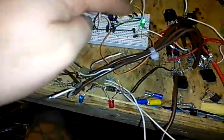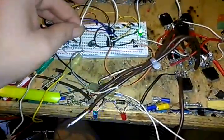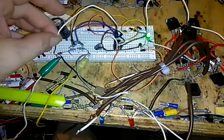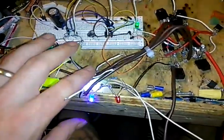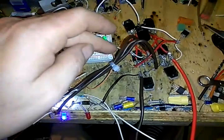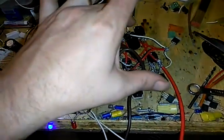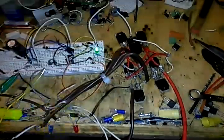Now when this is on, this is off, and I can show you that here using pin 7. Off on that positive and on that negative. So they do fluctuate back and forth, which is exactly how this is supposed to work. When this is off, this is on. When this is on, this one's off. These two are the same as these two, and then this one is reversed from this one. It's a different transistor, but nevertheless, it's exactly what I have to have for this.